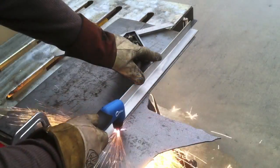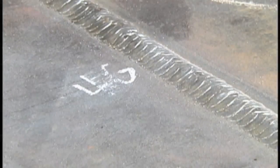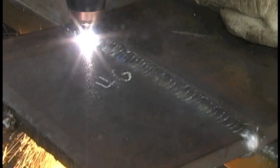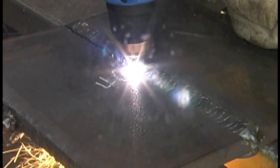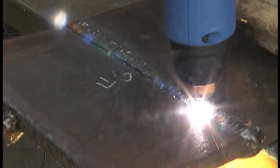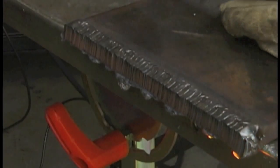Just about done. And just to make use of the scrap, I'm going to even this up. I want to store this piece away but with all those odd shapes on it, it just doesn't store very well. So using this piece of angle iron and that drag tip, I can make a nice cut. It's like a poor man's shear, really — you can get a straight cut almost as good as you can with a metal shear.